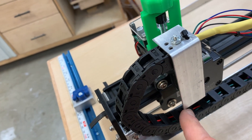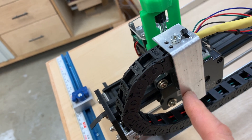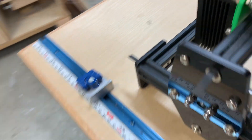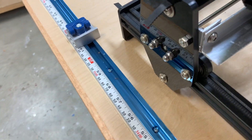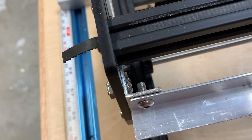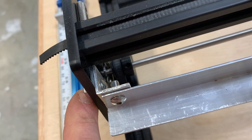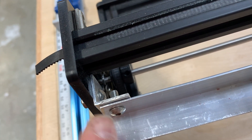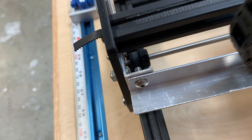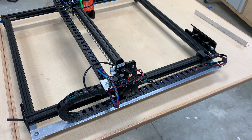Moving to the other end — this is just a bent piece of the flat one-inch material, with double-sided tape stuck to the back of the stepper motor. Down here I have a little three-quarter-inch piece that's bolted with one hole there and one hole here, and that mounts to the support track.